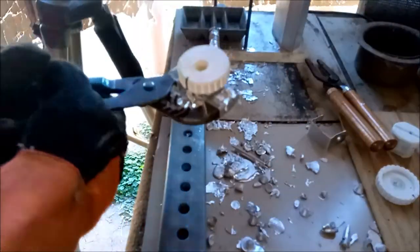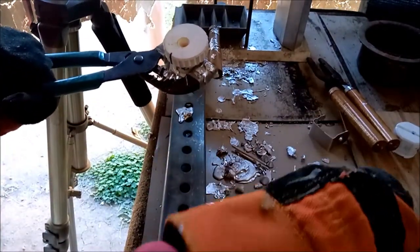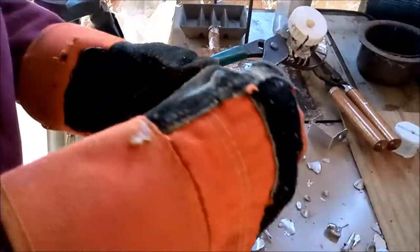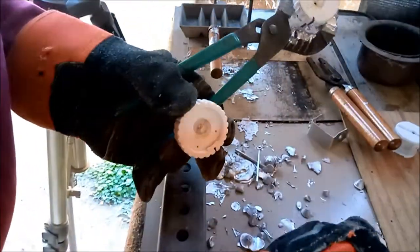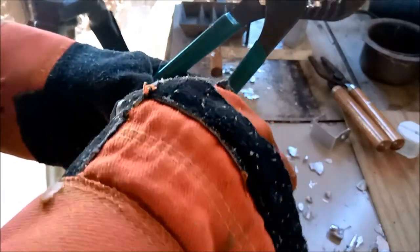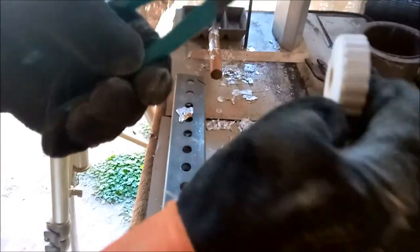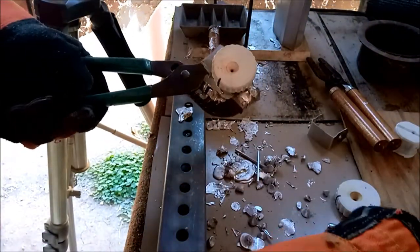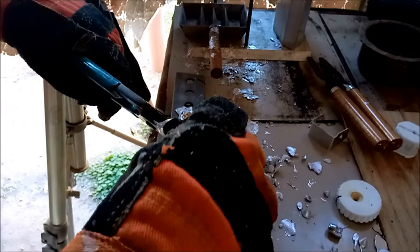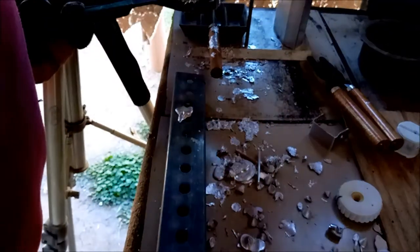Trying to line up my lines so that the sprue hole opening aligns with the center of the base of the bullet. I am discovering that I have another weak point in the form of super thin edges, and that's the bottom of the mouth. Where it tapers down, it creates a sharp edge at the bottom. That's proving to be another weak point. So it's possible that that's something else I'll have to address later on down the road.